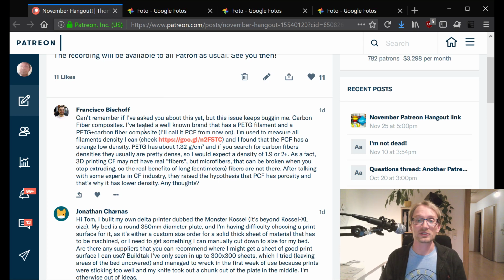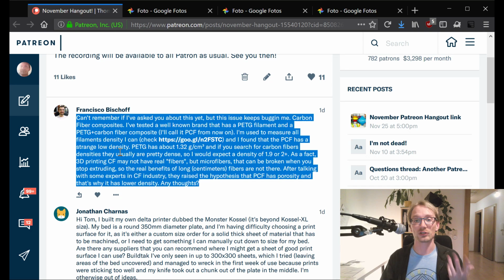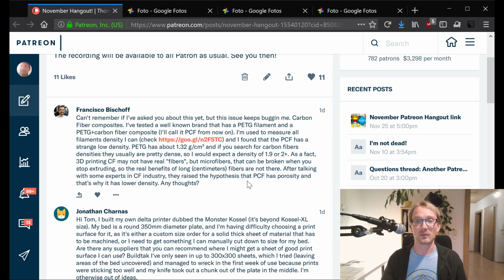Francisco Bischoff is asking about PETG plus carbon fiber and PETG. He has two different filaments from the same brand, and theoretically, PETG has a density of 1.32 grams per cubic centimeter. Carbon fiber is denser than that, but he's found that the PCF, so the carbon fiber plus PETG filament, has a strangely low density. Doesn't say how dense it is exactly, but he, or someone from the carbon fiber industry, has the hypothesis that the composite has porosity, and that's why it has lower density.